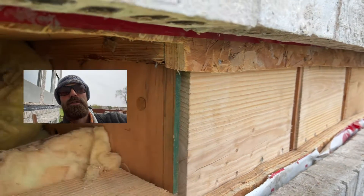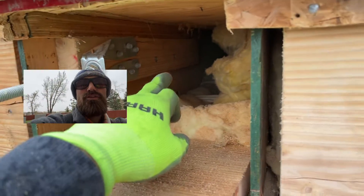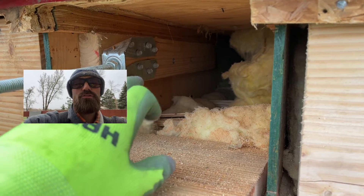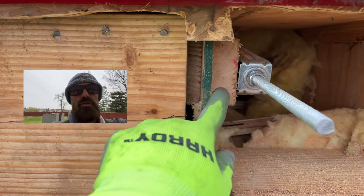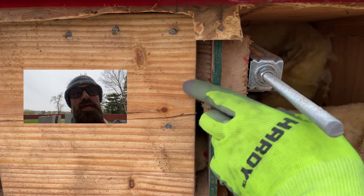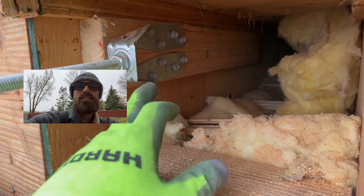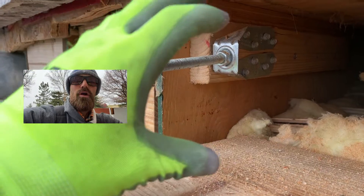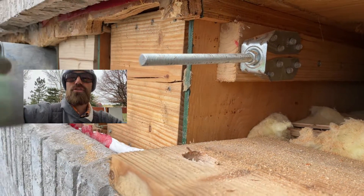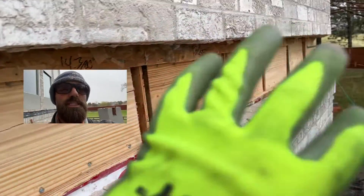The engineer drew up a drawing and here's what we came up with: two-by-fours that are two feet long with Simpson SDS quarter-inch screws, three and a half inches long, six of them going through and screwing through so the SDS comes through the plywood and tags through the other two-by-four on the other side — sandwiching it all the way through. Then we put in the Simpson DTT2Z with the nut and thread all back in here, so once we put our ledger on we'll attach this side to the joist. That gives us lateral tension to keep the ledger from falling off.